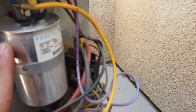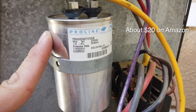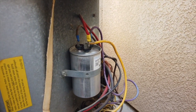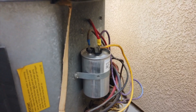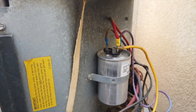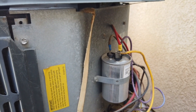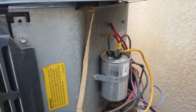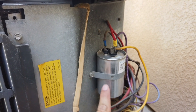Once that's done, the first thing I would always tell people is to replace this capacitor, because this is going to be your cheap fix. Always replace it with exactly what you took out — it doesn't work like a universal fit, you have to put the same one in. Start with that and see if it revives your fan motor, because this capacitor feeds a starting charge to both your compressor and your fan. When replacing the fan, you should always replace the capacitor at the same time.